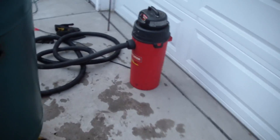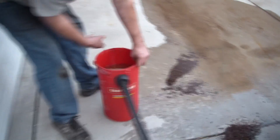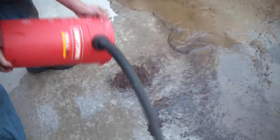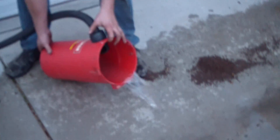But it's a thick wall tank so it should be okay. We're actually pumping out the water and rust mix out this hole in the bottom. There's a little quarter inch hole in the bottom — there's no way you'd get that stuff out of there otherwise. Here's a look at the rust bath; there's still quite a few particles in there. This is after about a dozen scrapes and flushes.